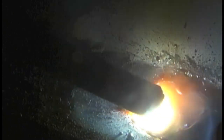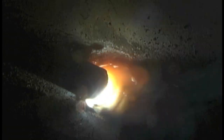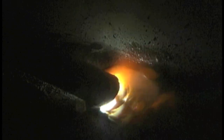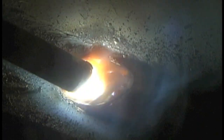Here's a second pass. You watch the very bottom of the rod — it pretty much looks like it's scrubbing right on the base metal. I can feel it rubbing, but the arc is not at all wanting to stick on me. I've got it in slow motion right here so you can kind of see the variations in the arc length. That's what arc force does — it compensates a little bit for your variations in arc length. If you get too close, instead of sticking, it just bumps the amperage up and you'll keep going.